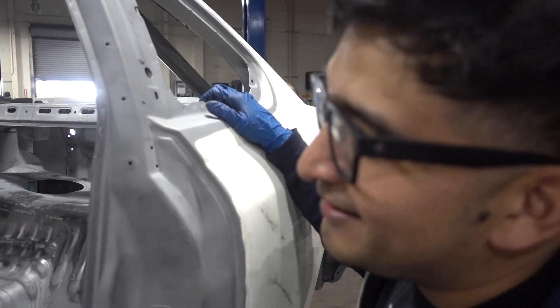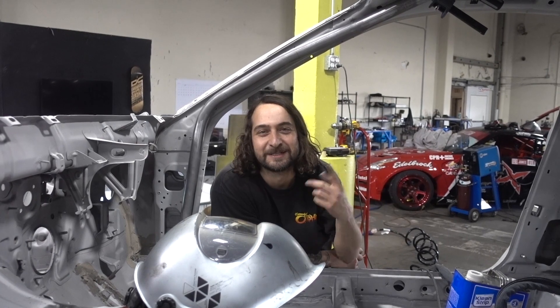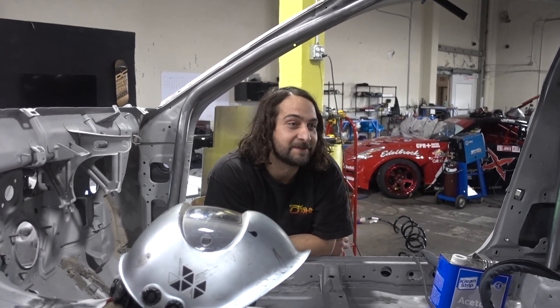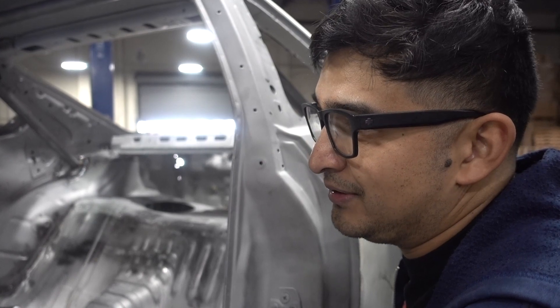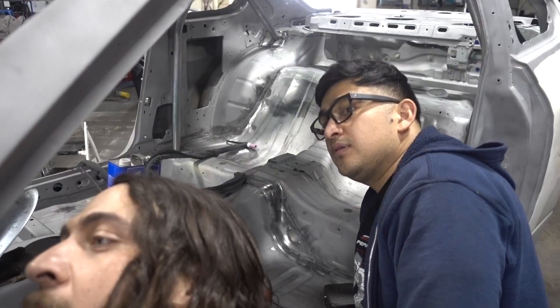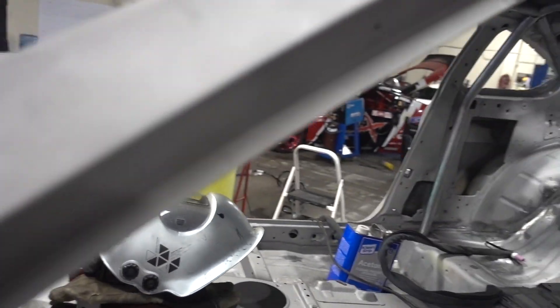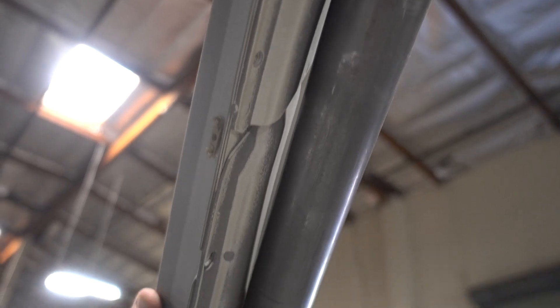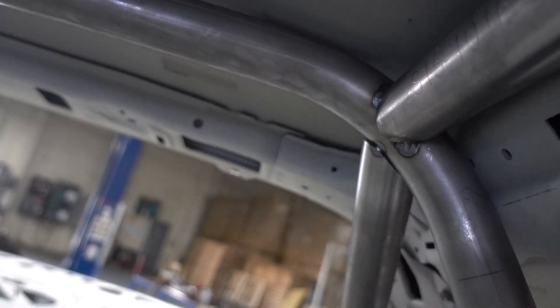That took you less time than cutting all that manually. Yeah, once we got this side it was like what — ten, five minutes? I could get the rest in another five to ten minutes. This went from like a five-day endeavor to maybe 16 hours. If you were really moving, you're looking at like five or six hours. You could probably put a gusset if you wanted to, but it's not necessary — look at that, this cage is its own brace. It's so tight fitting. There's not a single gap up here — this is all perfect. Perfect, so sick. I'm never going to make a cage ever again.